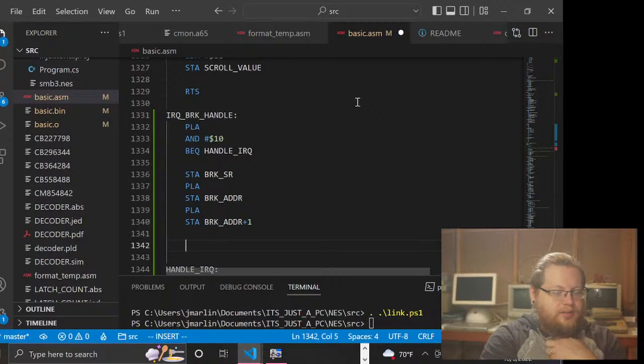The next step is we have to define the shape of our parameter block. We could always just make it a standard size. I don't know how ProDOS does it, because for that ASCII string one it makes sense and is relatively easy, since you're just stepping through the address, and the address you have at the end you can just use. You could do a similar thing for the parameter block, where your code for reading it just keeps increasing the address, but I don't want to mess with that too much, so I'm just going to use a fixed block size. Is that silly? Nah, I'm just going to go with it. That seems like the easy way. Let's pull a number out of our ass, because we can always change it later. I'm going to go with 4 bytes, for no good reason.